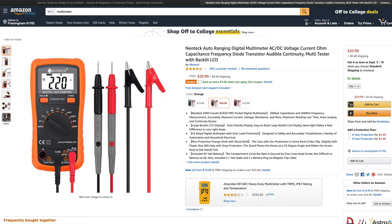If you do have existing doorbell wiring but you aren't sure of the voltage, you can usually find the voltage printed on the doorbell transformer if you can find it. Or you can pick up an affordable multimeter from a hardware store and test the line.